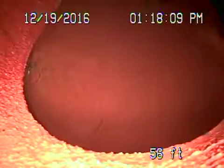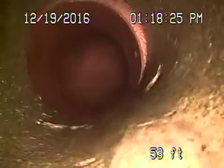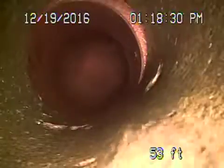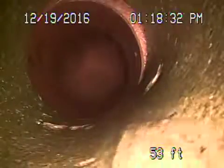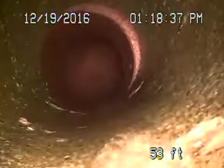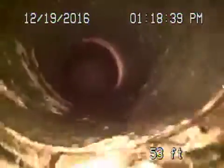Here's your connection to the city sewer. This is nice and clean — this is a clay pipe that the city probably replaced. They gave you a new Y connection. This section is nice and clean, and then they tied it into the existing clay pipe. You can tell the city had replaced their sewer line recently — you can actually see the patch in the street. Here's where they tied into the existing clay pipe. This is all your responsibility, even that section in the street.